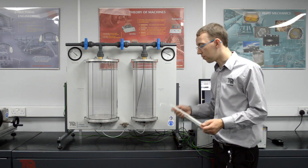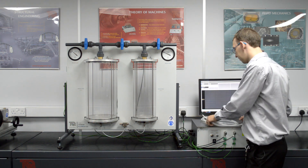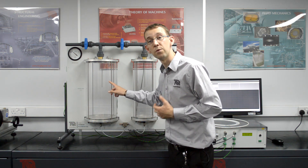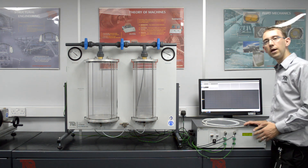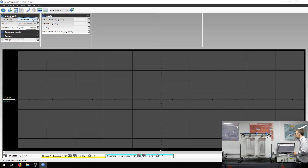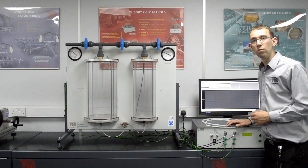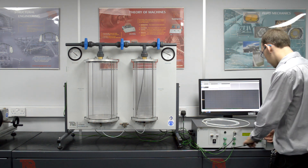Once you have reached your desired pressure, it is always best to remove the tubing — especially from the vessel end first — as air will leak through the tube and through the pump. Once we've reached our desired pressure, we need to ensure the air inside the vessel is at the same temperature as the ambient air outside. We can do this by looking at the temperature measured by the thermocouple inside the vessel and comparing it to the ambient thermocouple. Inside our VDAS software, we need to select the required experiment from the drop-down. This particular experiment is experiment 2, using the pressure vessel. For accurate results, it is always best to enter today's ambient pressure. For this experiment, we utilise the fast inputs on the right of the control box, so we need to move our pressure sensor from the standard input to the fast input section.